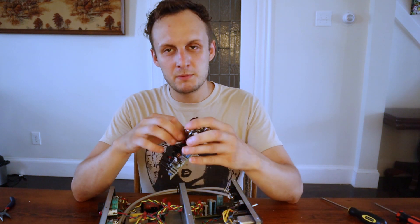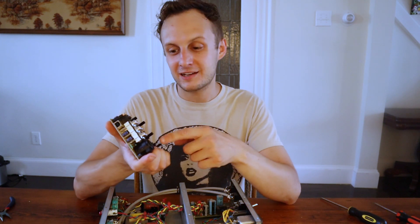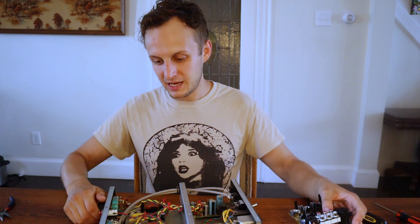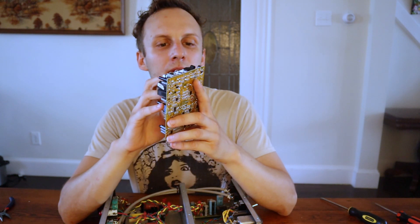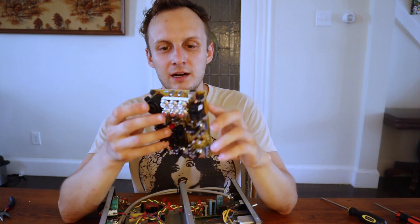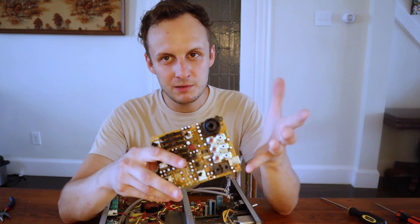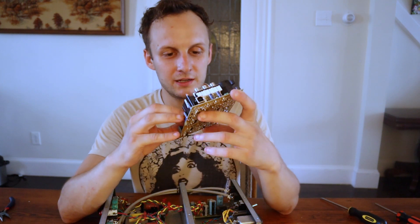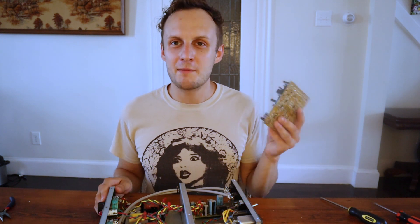The next biggest cost in build materials after the case is anything humans have to interact with — XLR jacks, switches, potentiometers — because those are the things that fail first since we're putting our hands on them all the time. Looking at the Behringer, this XLR is from Chun-Shing, so it's an off-brand XLR, probably not the highest quality. Same with all the other connectors. When you're making something this cheap, you have to squeeze every part for every penny, so they're all off-brand parts and they're going to fail someday. I've had this since 2013 — I'm on borrowed time with these parts.